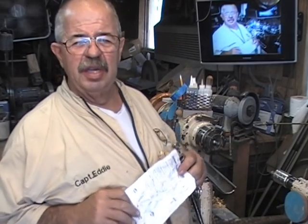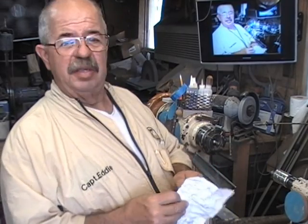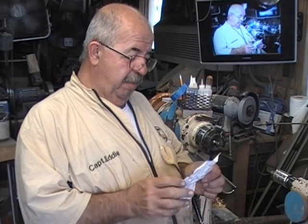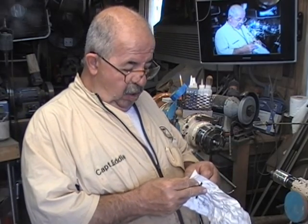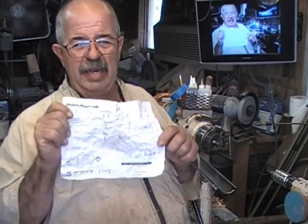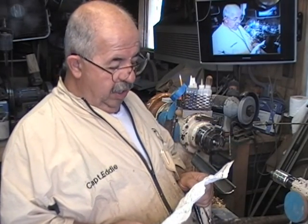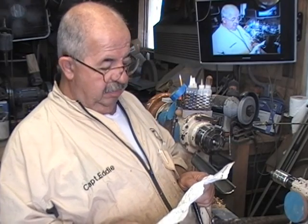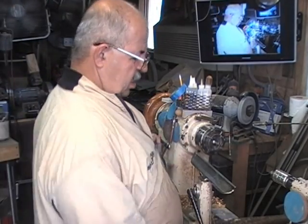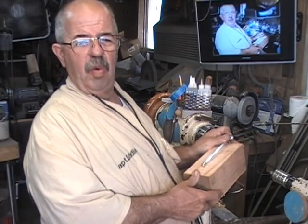The kit we're going to use is the Deluxe Peppermill by Craft Supplies. Now there's a great book on this by Dale Nish. It's the Essential Peppermills. They all come with a very basic instruction sheet. We're talking 1 page of paper. And it starts with select the 2 3/4 inch square blank 1 inch longer than the mechanism. So I'm going to use a short mechanism and a block of mystery wood. And I'm about an inch and 1/4 larger.